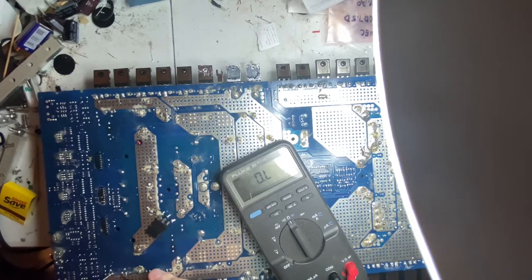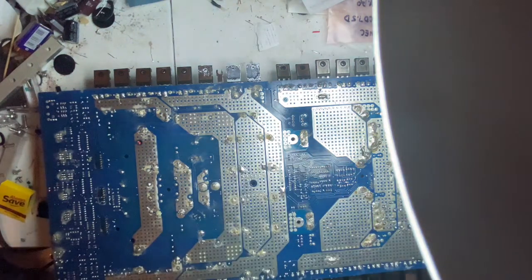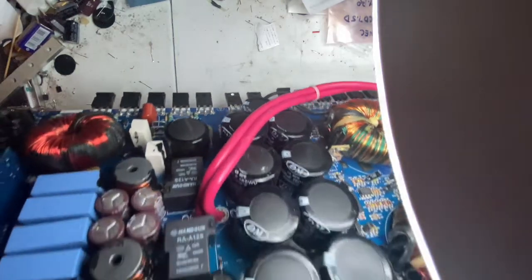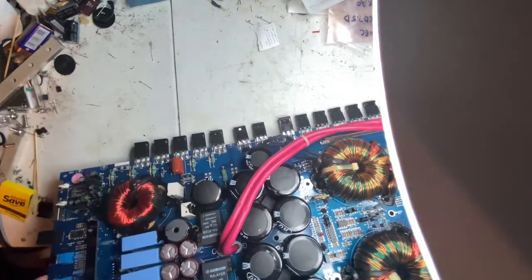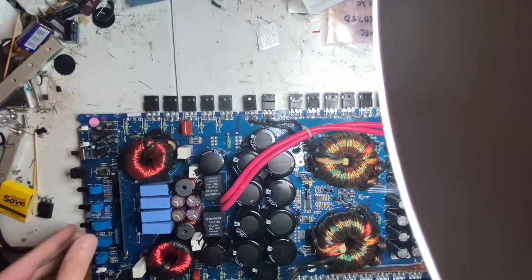And I'm actually reading resistance. 1.45K, 6K in reverse. Potentially only one component is bad. I'm going to flip it over and check from the top side since there's so much flux. And this board is so big and so heavy. I can't understand how much power this thing probably has.